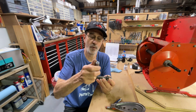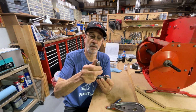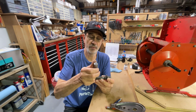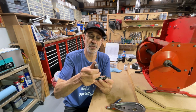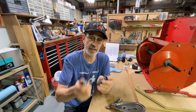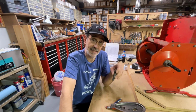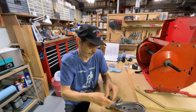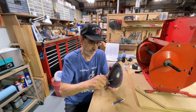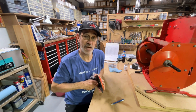It's 624, 624 and a half, 624. Let's turn it 90. 624.5, 625. I don't know how many machinists we have out there, but a 625 shaft is not going to go through a 625 bearing. So we're going to have to, yeah, that won't go in there. I guess we're going to have to run down the shop after all.